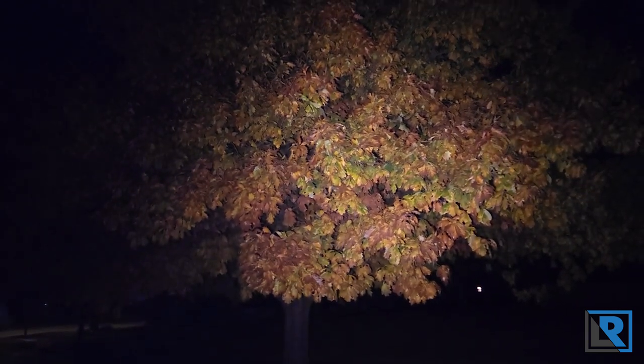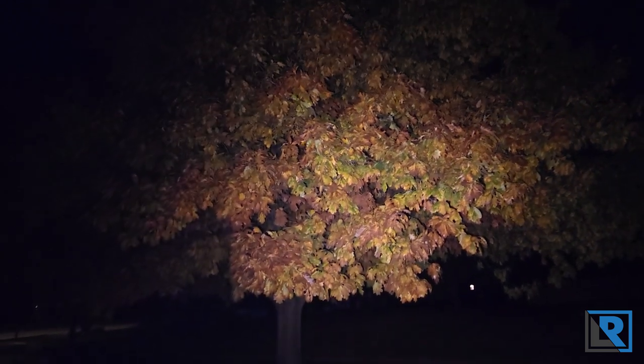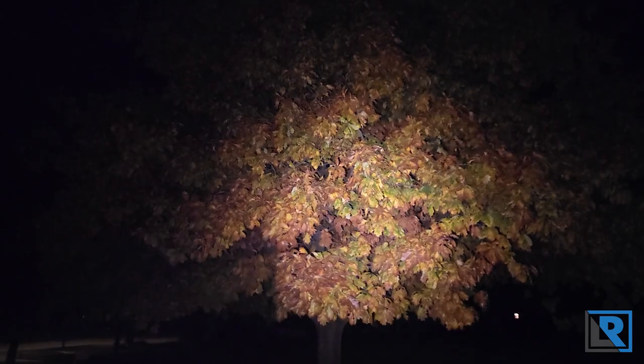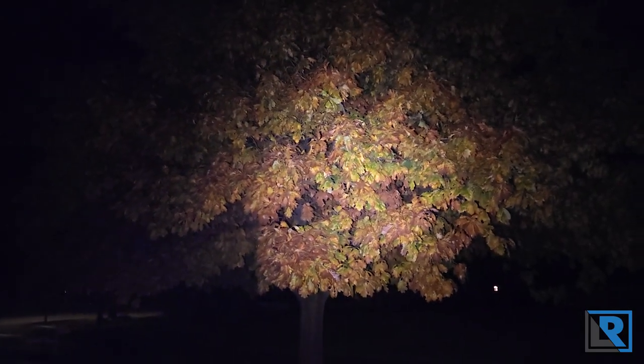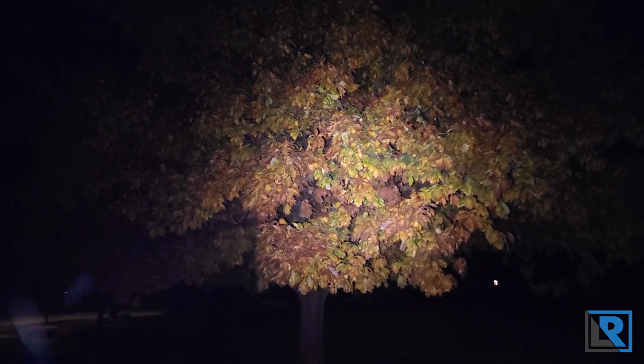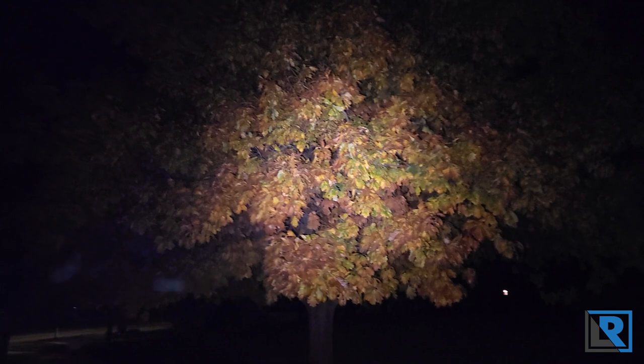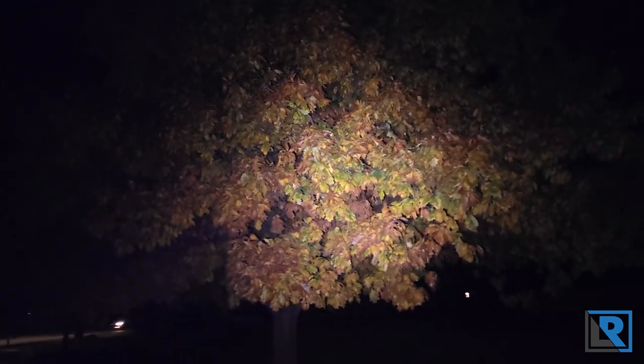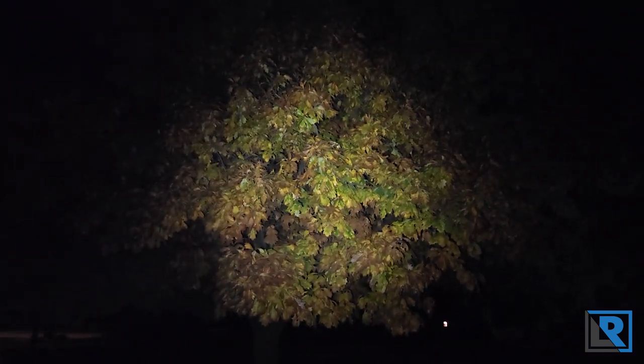I wanted to show the difference between high CRI. This is a high CRI LED, about 4,000 Kelvin, 96 CRI — you can see the nice colors on the tree. Switching to another Raylight Mini with a Nichia 219B LED: it's about 40 to 50 lumens less, just because it's a less efficient LED. This one's slightly cooler, probably a more neutral tone, and you can still see the oranges and reds nicely. Lastly, here's an Olight i5T making about 100 lumens less. This is a cool white, non-high-CRI LED, and you can see just a huge difference in the color of the tree.